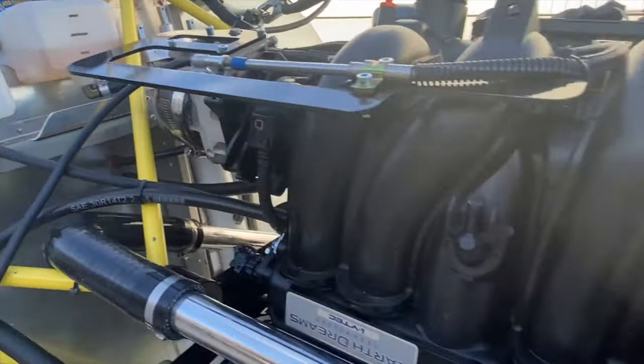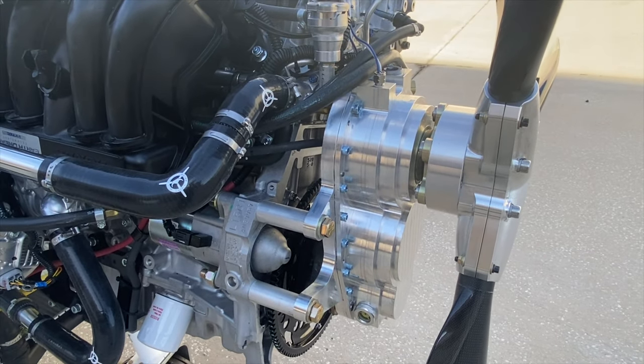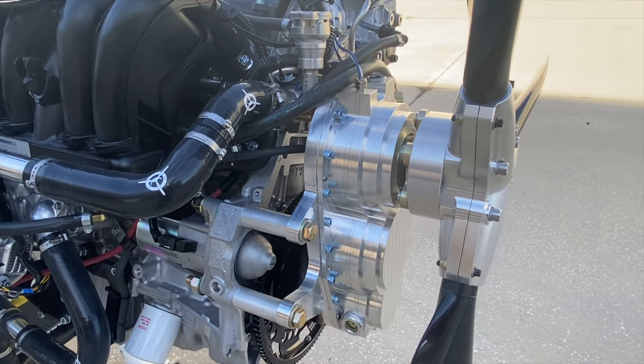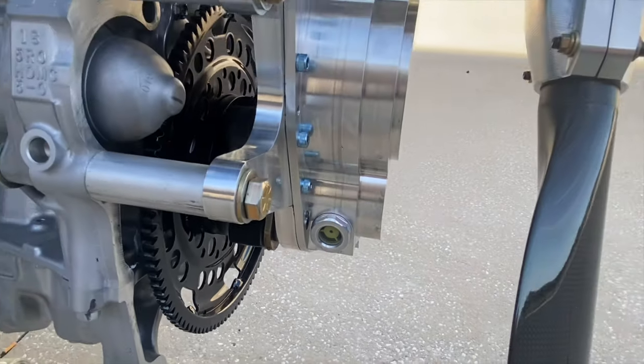We're running a venting system on the back of the gearbox. We now run eight ounces of lube and there's a slight chance a few dribbles of gear oil will come out, so we've installed a gearbox venting canister on the firewall next to the coolant canister. This is only to vent possible fumes of gear oil — it's not where you fill or measure gear oil. It vents through a little rubber washer and down through the coarse threads of the bottle. Don't tighten this too much — just down and a tiny bit snug. In the beginning you'll drain the gearbox often, and over time you'll build confidence as temperatures stabilize and the oil runs clean.